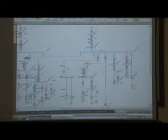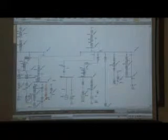But the next thing, you write that down. Number 1, open that breaker. Number 2 is probably put a lock on it and tag it out so nobody closes it while you're working on the bus. So number 2, you say, lock it out and tag it out. You're going to put a lock on it, whoever's in charge, whoever's working on it, and you write a tag on it and say, I'm working on this, so they can find you if they need you.